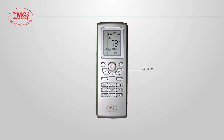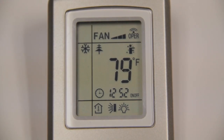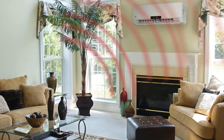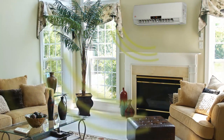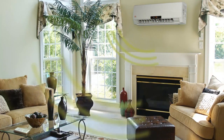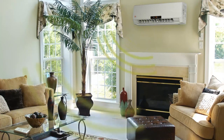The U-touch or iFeel button will have different labels depending on the remote, but will still have the same function. If you are comfortable at the current temperature where the remote is located, you can press this button and you will notice a figure of a person with stars around them on the remote. Once this appears, the remote control will send a signal of the current temperature at the remote location to the indoor unit. The unit will now set its temperature to the temperature at the remote control location. The remote and indoor unit will communicate every 10 minutes as long as they are in signal range of one another. Whether you turn the U-touch iFeel function off or it loses signal, it will switch back to the previously set temperature before the feature was activated. This is a great way to maintain your comfort level in any room.